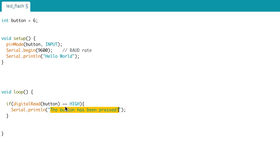So what I've shown you so far is how to use quotation marks to print specific messages to the computer from the Arduino. We can also print values of either sensors or things like buttons. What I'm going to do now is code it up so our serial monitor continuously prints the value of the button — it will print a 0 if the button hasn't been pressed and a 1 if it has. This is useful for checking the values of sensors while our code is running.